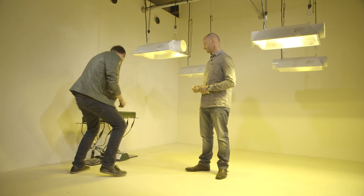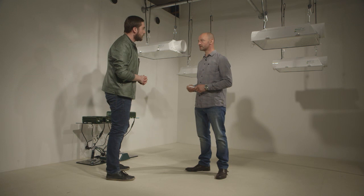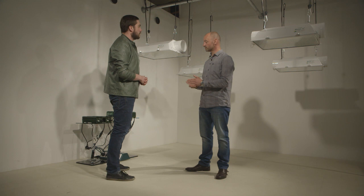Okay, and if you'd like to try and switch them back on again, we'll see that it's not restruck the lamp. So the unit has detected that the lamp is too hot, so it will wait at least 60 seconds until it tries to restrike again. And of course, it will strike them in sequence as per the ignition control.